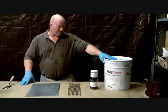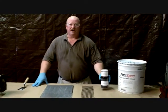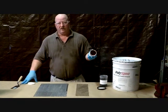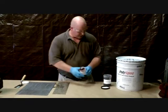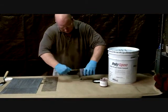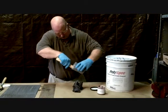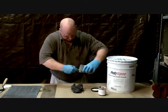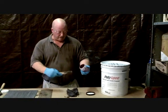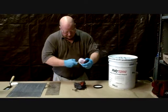Here's the kind of kit it normally comes in. We're going to mix a small one. Normally you'd open it up and use a power mixer, but we're just doing a small container here. One unique thing about this product: the hardener is red and has no beads in it, which makes it a little easier to mix. We're going to scoop out our resin — see how nice and thick it is. That's what you want because a lot of times you're troweling these products overhead or on a vertical surface. We'll use all of A and all of B. If you were going to batch it out — which we don't recommend — use separate paddles so you don't contaminate your product.